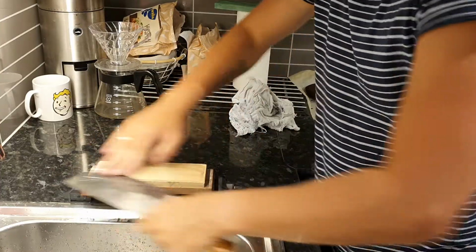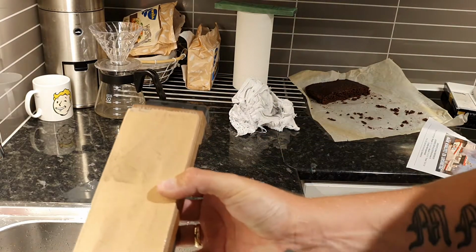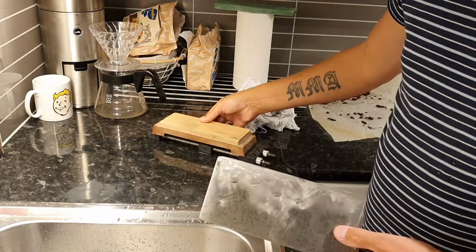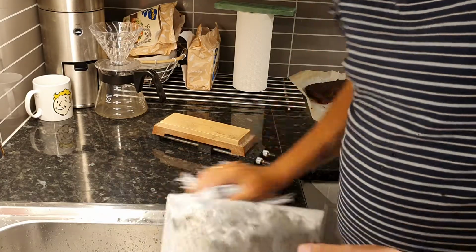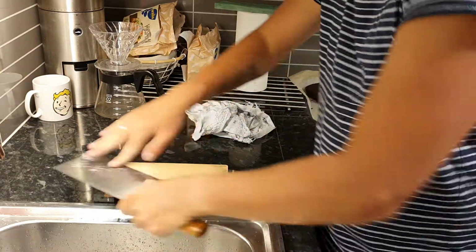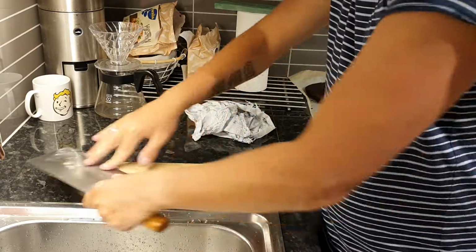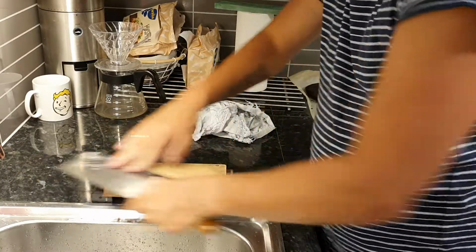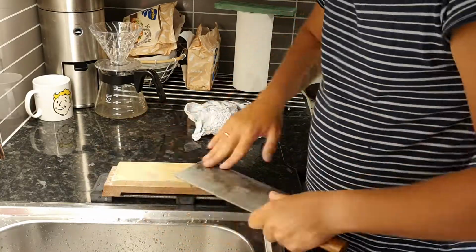King is actually a fairly decent stone. It cuts fairly decently quick on this softer to cut carbon steel. I would not use it on, say, M390, but on this it works fairly good. And again, using barely any pressure. It creates a slick mud pretty quick. So yeah.